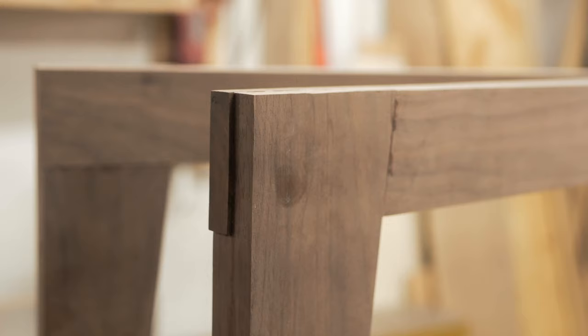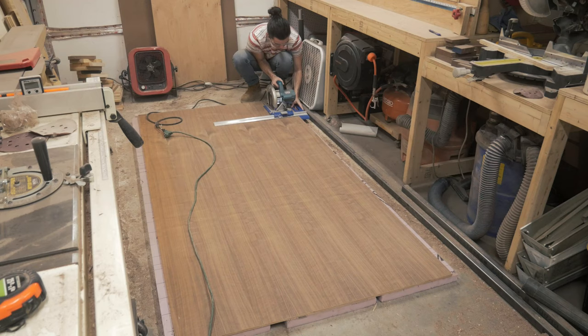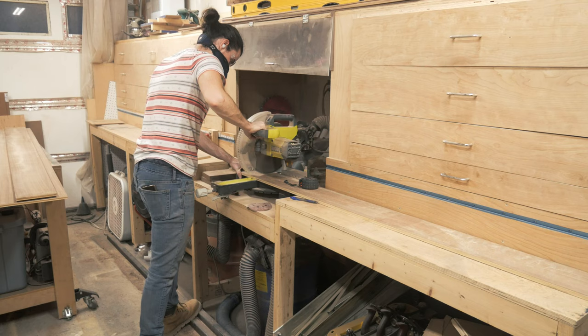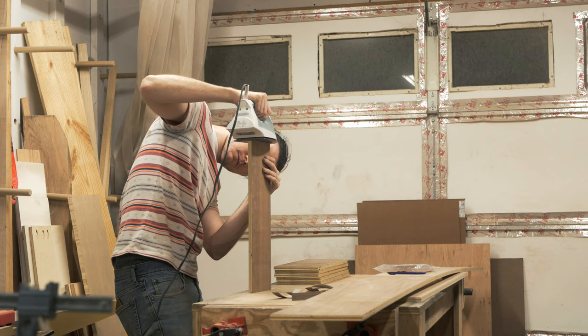The next day I came back and sanded the base and the outside of the cabinet up to 180 grit to clean everything up. I wanted three drawers for this table, so I used my Kreg Rip Cut Edge Guide to break down some half-inch walnut plywood, then cut everything to size on the miter saw. Next, I apply edge banding to the ends using an iron, then come back with a razor to trim the excess.